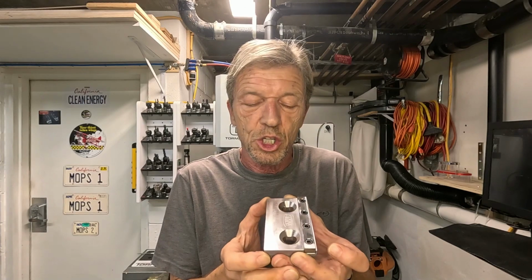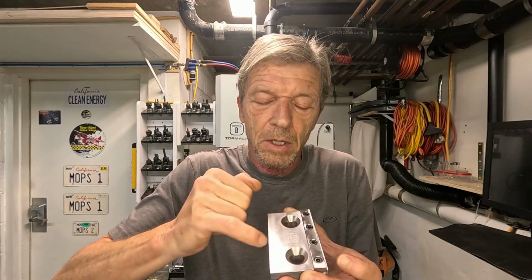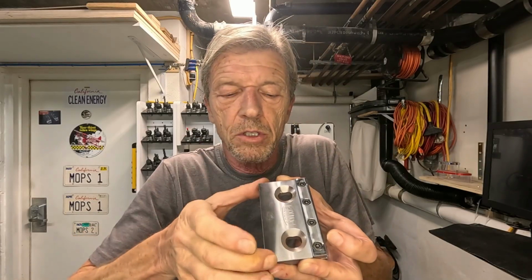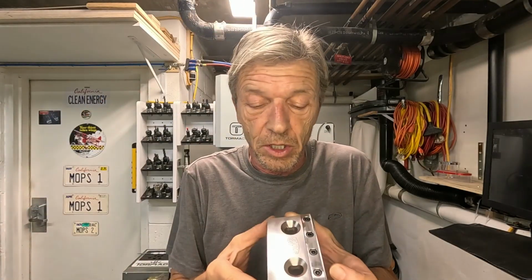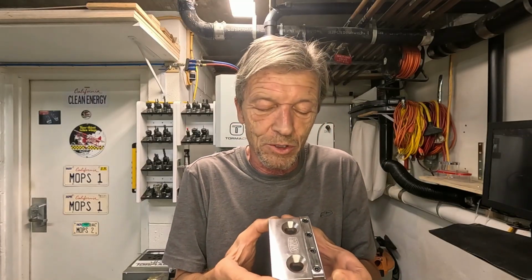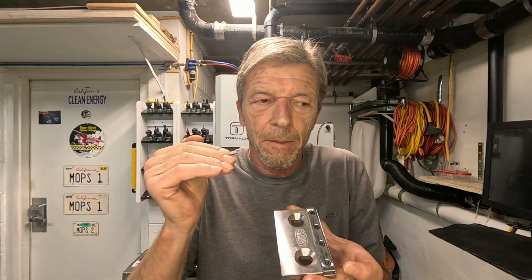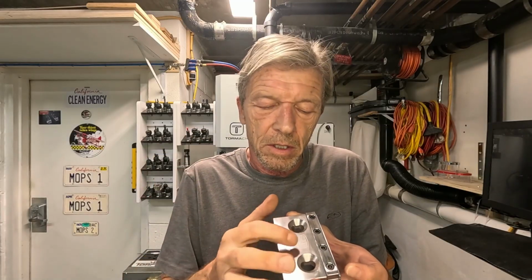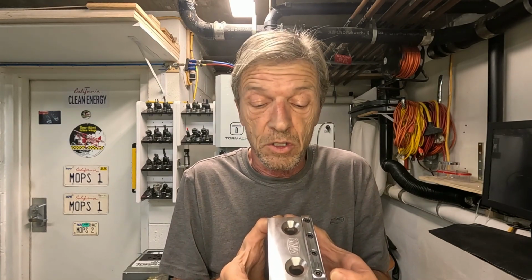The only challenge is to create this taper and the slot here, which allows the jaw then when you bolt it down to move a little bit. I tried different processes in Fusion with morphed spiral and all these things, and I ended up just doing these tapers with 3D adaptive with a very small step down. It gives a quite good surface. I know that 3D adaptive typically is not a finishing pass, but I must say it serves its purpose.